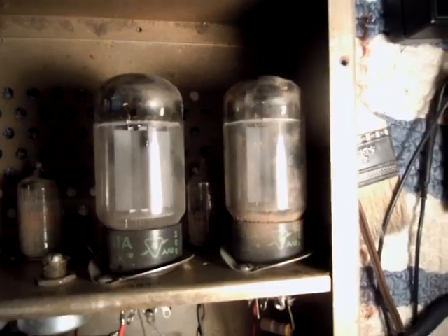It's got two capacitors in a voltage doubler configuration. It's got an OB-2 and an OA-2 regulator in the back, an OG-3, a 12AX7. In the way back it's got a 6AU6 and two 6L6 outputs. As you can imagine, the 6L6s take the brunt of the load.